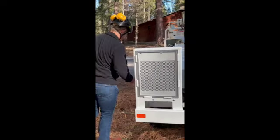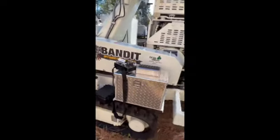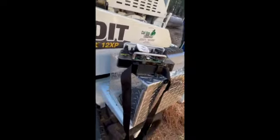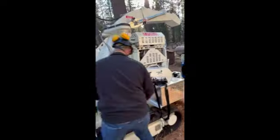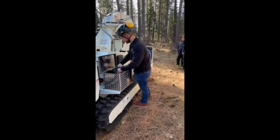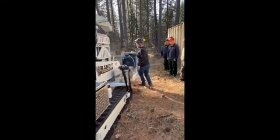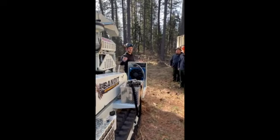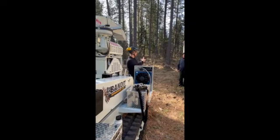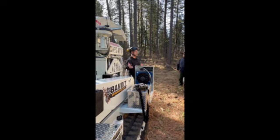So coming back here, guys, we want to start wrapping around. Now, with everyone having experience on a chipper, this should just be a refresher, but I'm going to cover it either way because it is the most important function on the machine, and that's referring to our clutch up there. As you guys know, you have 4 main components on this chipper that's actually doing your chipping, that's your maintenance items. You have your clutch, your belts, your knives, and your anvil. Those are your big 4. If one of those is out of whack, the machine's not going to perform like it needs to.